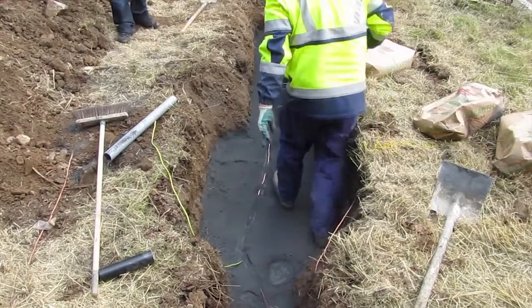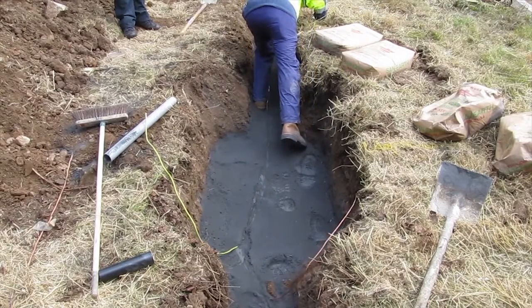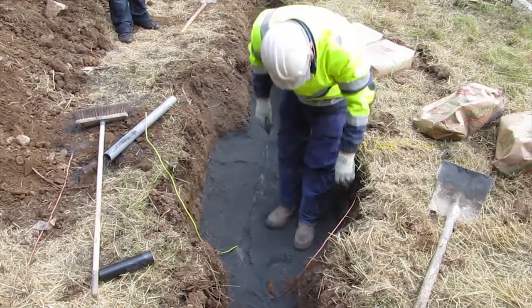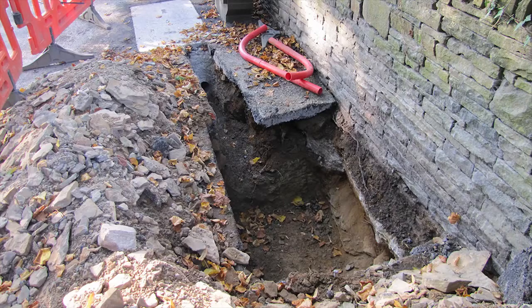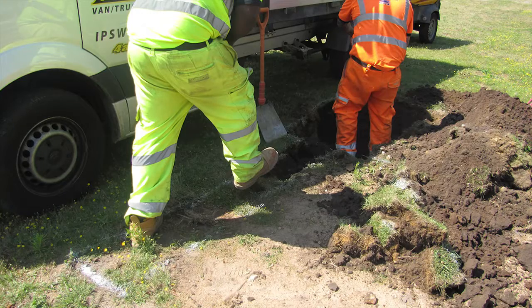If the telco duct trench length is less than 1 metre, then the power trench must also be used, using the alternative pre-attached copper tail, ensuring the conductive concrete material is also deployed into the power trench opening. Each site may differ due to location. Please consult with your CT supervisor and OpenReach contracts manager if there are any individual site issues.